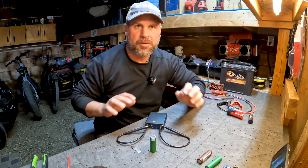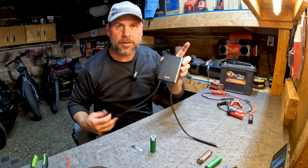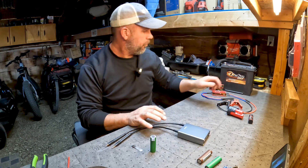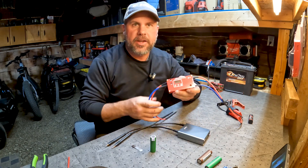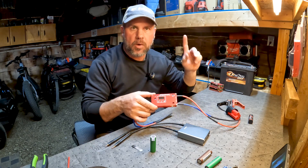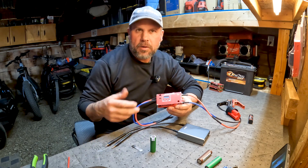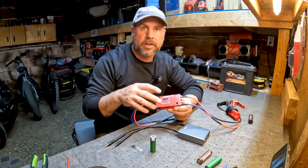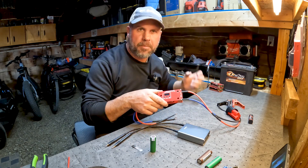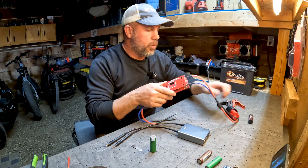I am really impressed with my new little mini spot welder — it's wireless in the sense that my old one, if I did a video on it, you have to hook it up to a big battery. This thing's like $25 and a lot of people are having a problem with this thing blowing up the mosfets because they were using the wrong size battery. We have to use a big car battery, something that can really push out enough amperage to keep those mosfets from blowing up.